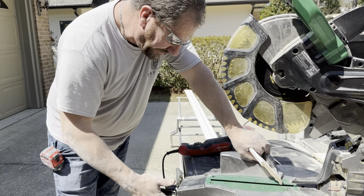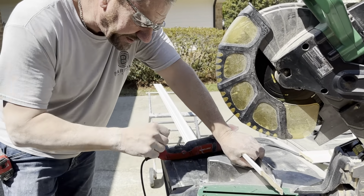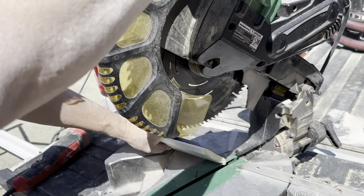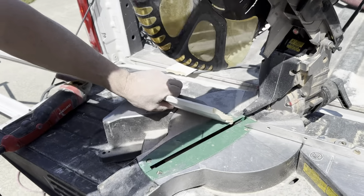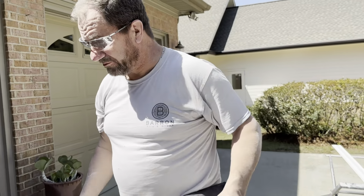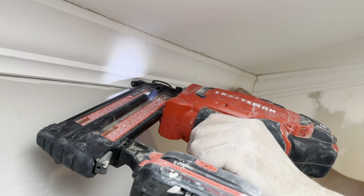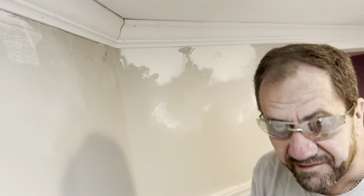So I'm at 22.5. I'm going to knock this down to 21.5. Just take a degree off the bottom. Little amounts make a big difference here. So I'm going to set the saw blade up so the top of the saw comes down the same place it was, but you see a little bit come off the bottom of the cut. So that was just 1 degree difference, 21.5 instead of 22.5. And to me, it looked like we lost about 1/8 of an inch there, which is probably about right what we needed. There we go. We caught that in, just a real small joint there though.